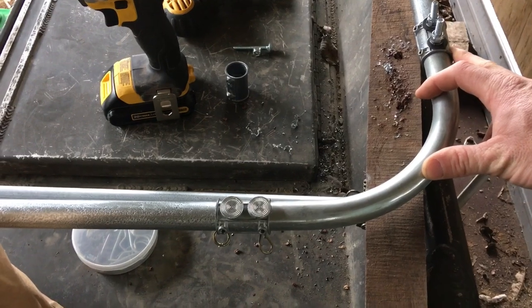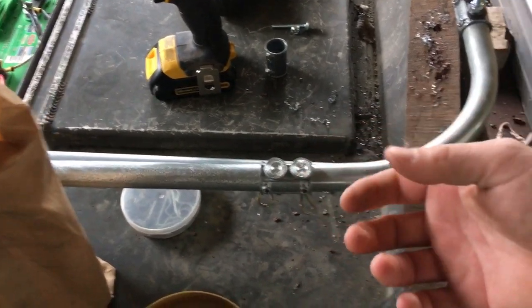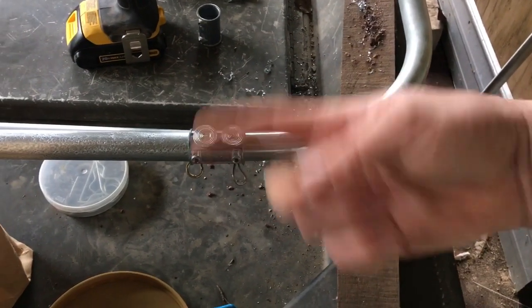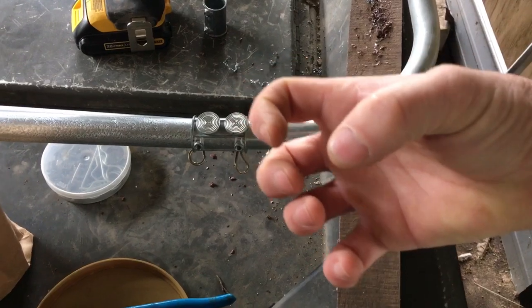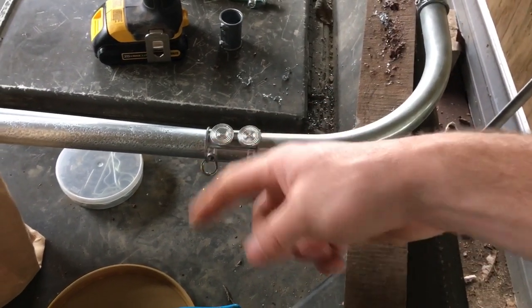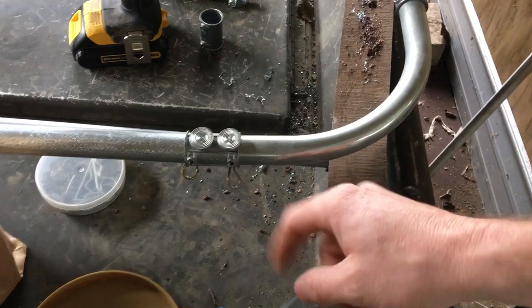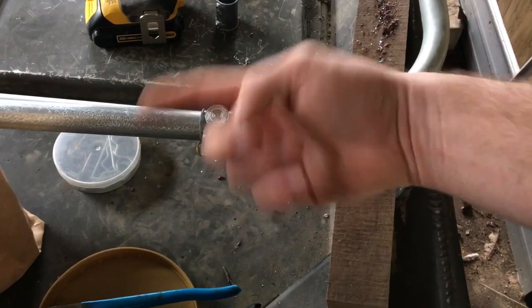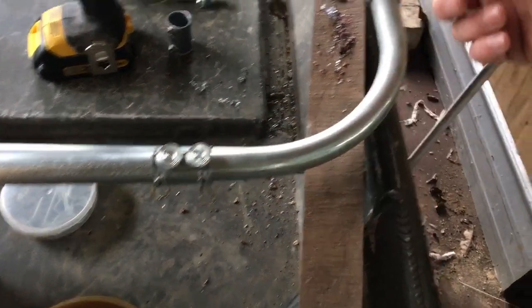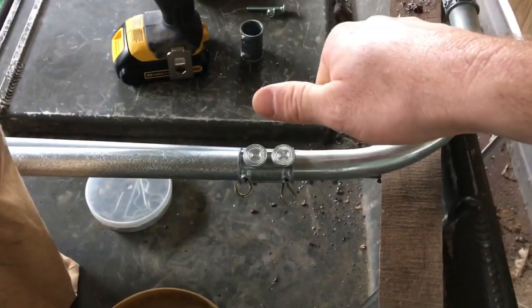Actually, what I've got is made by Loctite. It's the same thing. It looks like the material of a cast. When you break your arm, your doctor wraps it up, and it's kind of wet and warm, and then it sets up and dries really, really hard. So it's made for pipe repair. Anyway, I'm going to take this Fiber Fix when I get everything assembled, and I'm going to wrap every one of these joints to help strengthen it. That way that will eliminate the flex.